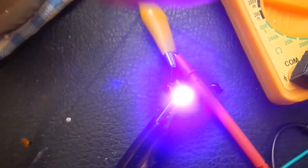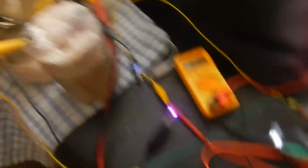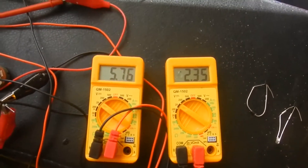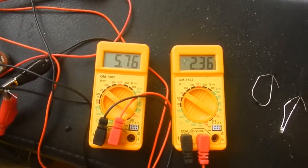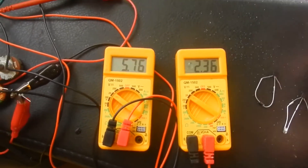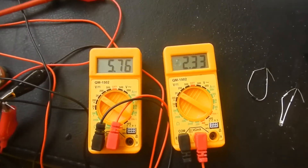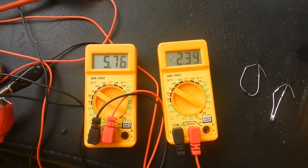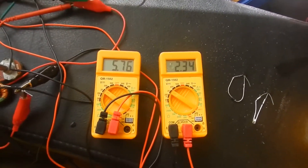As that transistor is clearly turned on — indicated by the LED being on — there's no voltage drop from the collector to the emitter. So I've got a 3.5-something volt differential charging bonus, which is what you need to charge a battery. I do get less milliamps, obviously — Ohm's law applies, so the same watts are going through. I've worked it out: it's very close to the same watts, with a tiny loss — it's been 98% efficient. But pretty much the same watts going to your battery, just at a higher voltage differential. If you just hooked it straight up to the capacitor it does still charge the battery, but I think this works better.